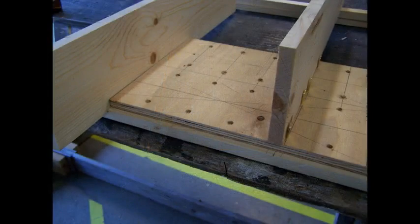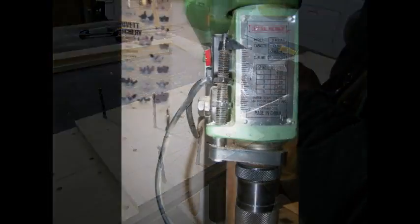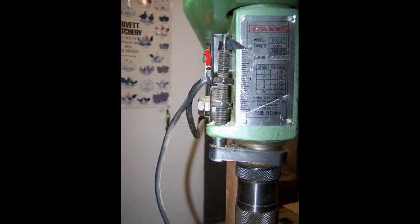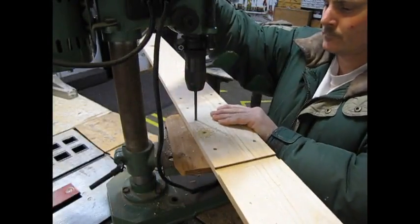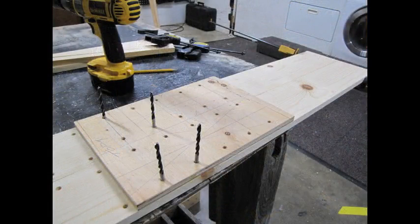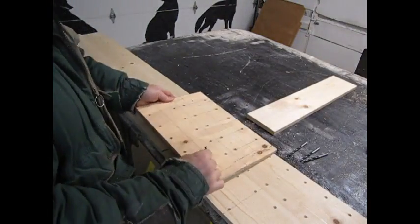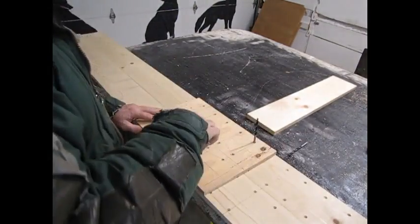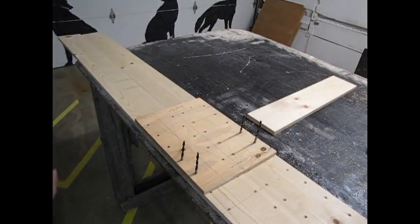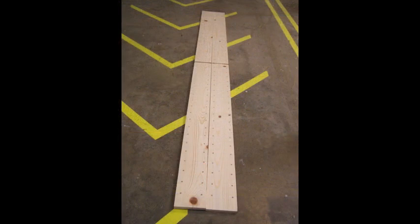You're ready to start drilling. Butt your template up against the center shelf, drill out each hole just enough to leave an impression in the wood. Set your drill press depth gauge to just a little deeper than your pins, then go ahead and finish drilling out those pre-started holes. Reinstall the template over the last two holes you drilled, use drill bits to hold it in place, then continue the process until you're finished doing the bottom of the board. Now drill up the top of the board: lay your template over the top two holes just below the dado cut, hold it in place with drill bits. When you start drilling, make sure you don't drill the hole directly over your dado cut — skip it — then finish out the top of the board just like you did the bottom half. That's it, you're all done drilling holes.